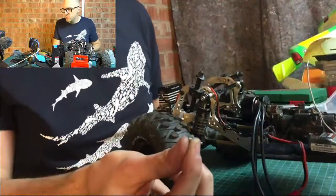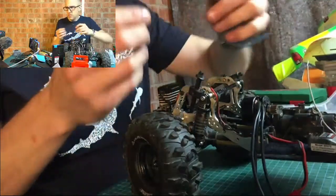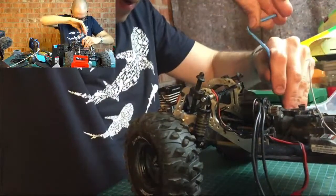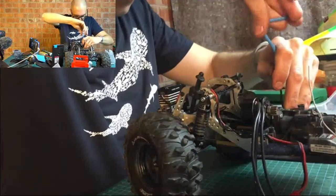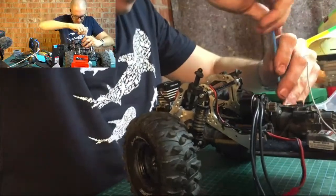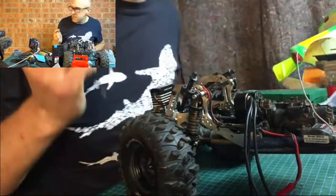And then the helicoils probably won't get picked up on camera. They're like compressed springs, and they have a little slatted bit that allows them to sit on this tool, and you just wind them in to whatever you want to apply a thread to. And if it's 3D printed stuff, it's usually soft enough plastic that you can just wind them straight in. And then usually you end up snapping the bottom off. And then you pull it out, and then that's it. I have a metal thread in there.